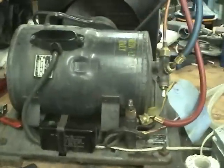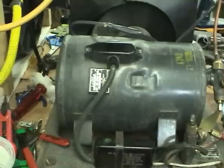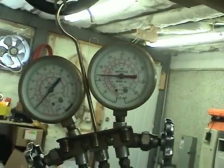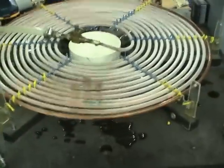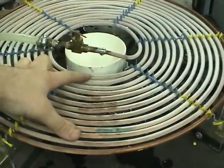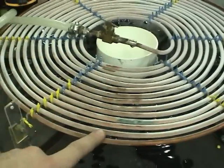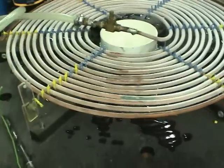At some point I'm probably going to take this down soon. I'm quite interested in seeing how this old compressor is built internally. I really don't have any use for this old condensing unit, so sometime soon I'm going to cut this open and make a video of that. That's pretty much stable now. One thing I noticed earlier when I had it running before is the inside turns of this coil were not freezing up, but the outside ones were. My theory is that this tubing is too small and the high-speed gas flow was causing a pressure drop, so the pressure on the outside was actually getting lower, meaning the temperature was lower on the outside than on the inside. But this was just a cobbled-together system, so what do you expect?